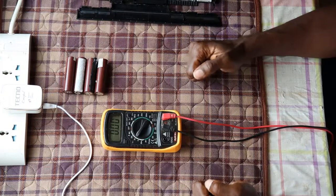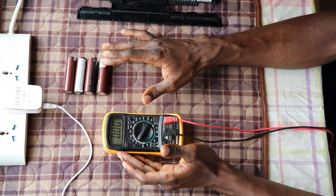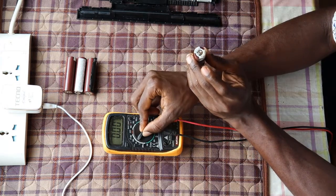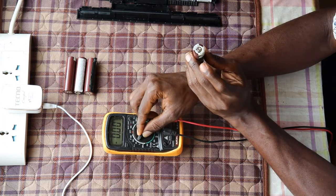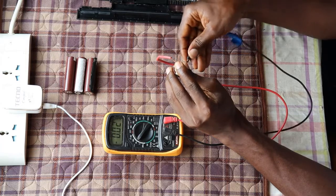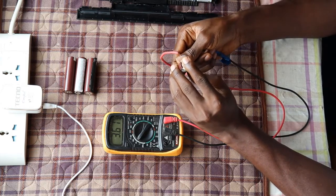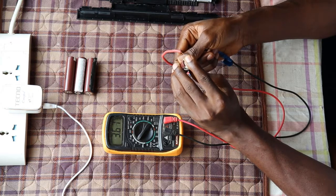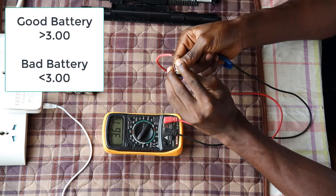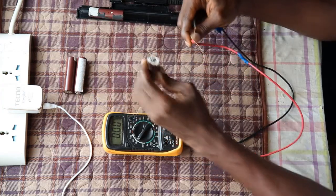Next, we're going to use our voltmeter to check the charges of the batteries we just harvested. We take them one by one. I've switched my voltmeter to 20V DC. I put my positive probe on the positive side and my negative on the negative — it's reading 3.61. That means this cell is in very good shape and we can use it. If you get anything below 3.00, throw that cell away because it wouldn't be fit for a power bank. This one is good — check the next one.